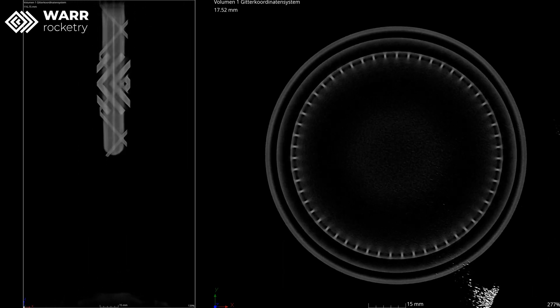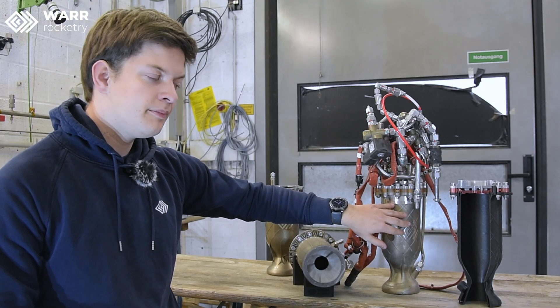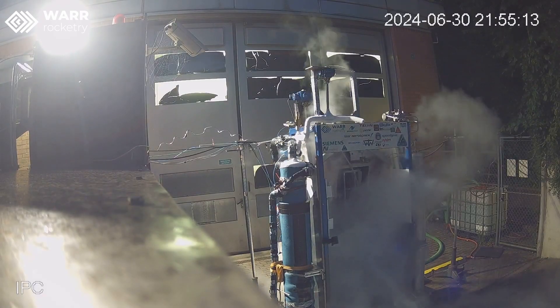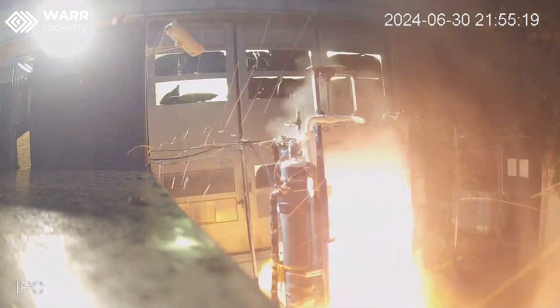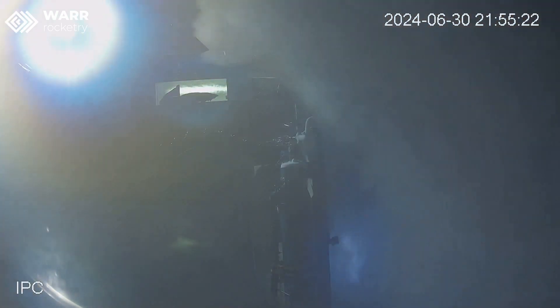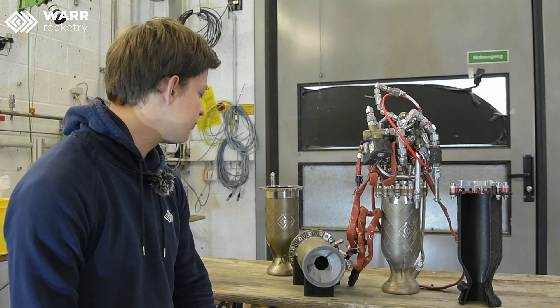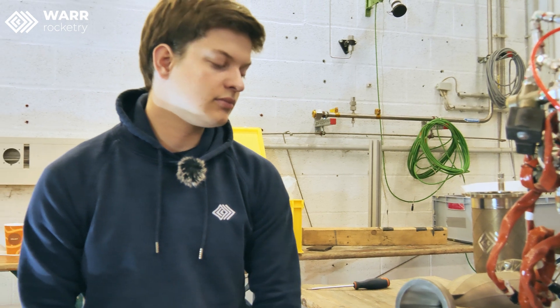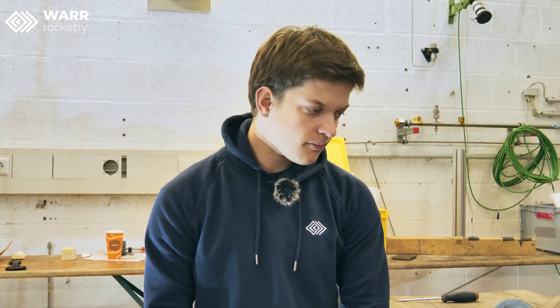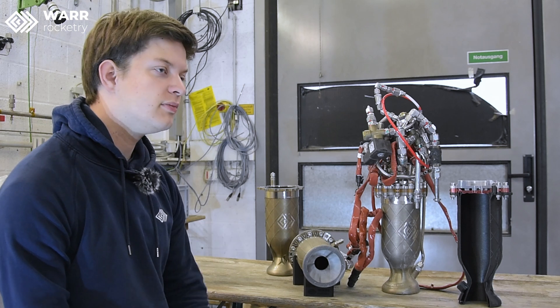So this was Rota. The reprint of that is Brunhilde, or Bruni for short as we call her. This is the engine that we then actually hot-fire tested and flew this year at EuRoC. It's basically exactly the same as Rota, with the only difference that we removed the ports and the decorative v-ribs at the bottom, because we didn't necessarily need them for flight — they were just there to get additional data to help us verify our design methods. So we decided to not try our luck again and just remove them.